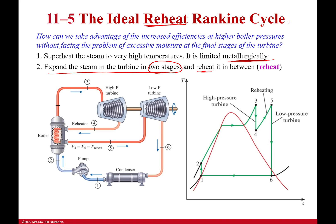There's a lot going on in this picture, so let's go through it carefully. Some aspects are the same: we still have a saturated liquid being pumped, we still have our boiler heating everything up, and we still have a turbine taking it back down to a saturated mixture of high quality. What's different is the area in between. Because we can't increase temperature infinitely, we go ahead and remove some energy from the flow with this first high-pressure turbine.